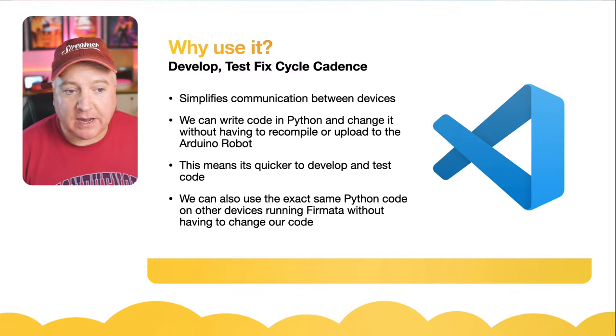There's another one, which is the really small Smars Mini. That's got the exact same motherboard on it as well. And the Pico is just like the ESP32 or 8266. That's 3.3 volts. So whereas the voltages are coming out of this thing and going into the pins on the Pico, you could essentially just replace that Pico with an ESP and it would work just the same with Python as well. No issues there. So you probably can use one of those, and they are a lot cheaper than the driver boards that we use for the Unos.